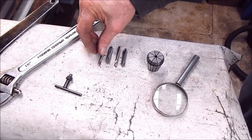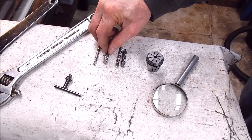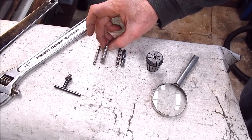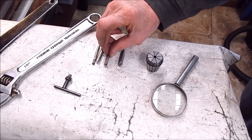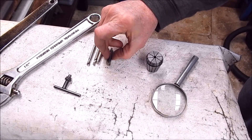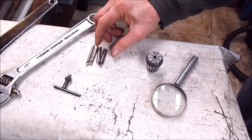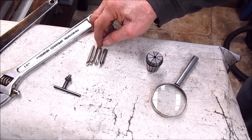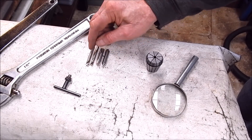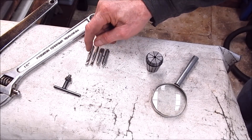You can do it with the broken drill stubs as well — grind it to the correct angle and then just do the back relief by hand. That's a big center drill. Here's another broken drill. Here's one that's broken on one end — I've made it into a spot drill and it's still good on the other end. So yeah, you can salvage your broken center drills and your useless drill stubs — turn them into something practical.